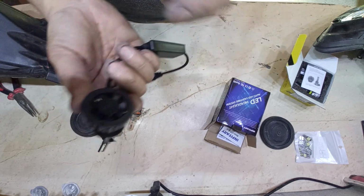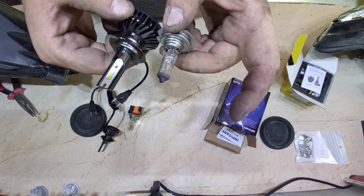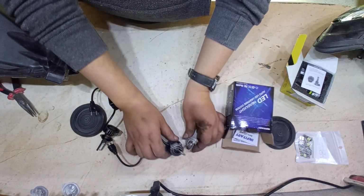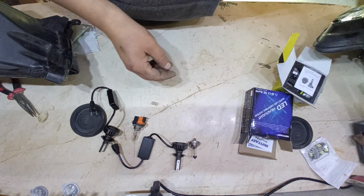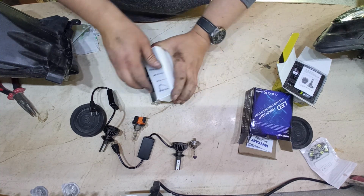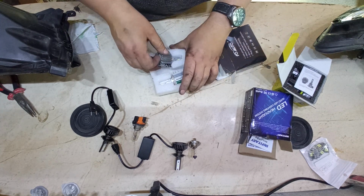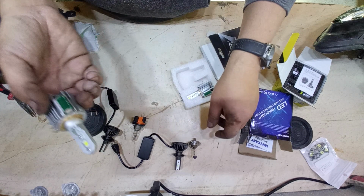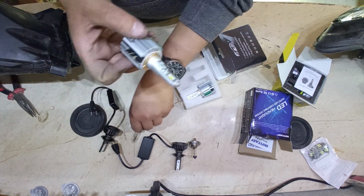So these are H7. The short beam are H7 light bulbs. You're going to see it in the description as well. So we have those sockets. These are the daytime running lights and long beam. They have three sockets, three plugs, just like this one.